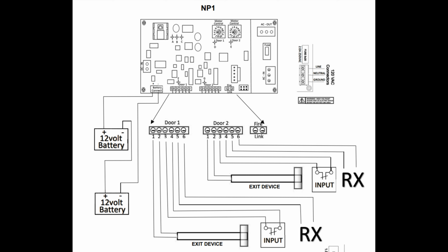Right. So what was essentially happening was whenever they swiped the card, the motor was being powered on, but then it would power completely off, so it wasn't doing anything. Yeah. It makes a noise when it powers on, and then when the thing actually tells it to unlock through its input, then clearly it works. So I just had the tech rewire everything, and it's working perfect. Voila!